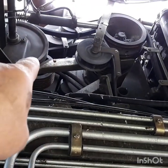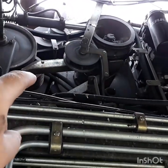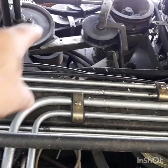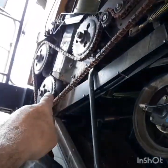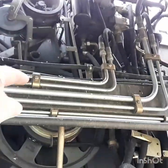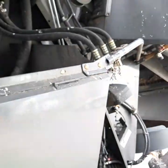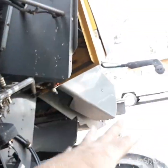The next belt out on the engine gear case is for the unloading system — all of this stuff is just hydraulically engaged, you can see the hydraulic cylinder right there. It comes out to one belt, over and down for our unloading system and grain tank. The very outside belt runs back to the chopper. The neat thing is when you turn on the threshing system, the chopper turns on first and then the threshing system. So if there's a slug in the rotor or you did a power shutdown, you're not turning on separating and the chopper at the same time while things are winding up. That chopper is already up and running when threshing turns on, so it immediately blows material out.